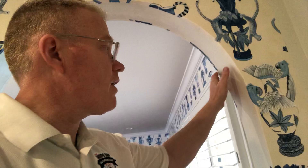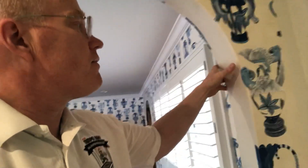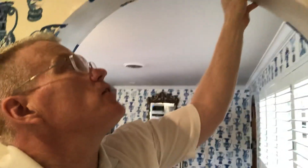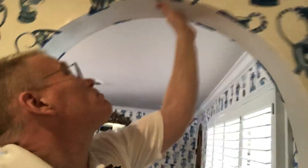But if you cut it too much, you're going to defeat the purpose of having this flap. The idea of having this flap is to have the whole edge covered with wallpaper. After you do that, you manipulate the paper. Look what I'm doing with my thumb — you can never sufficiently pull wallpaper over a corner. It always wants to relax back and give you a rounded radius. To avoid that, put a lot of glue in the corner. Use a special glue — especially tacky, Romans 535, super tacky, or border adhesive. It keeps that paper in place.